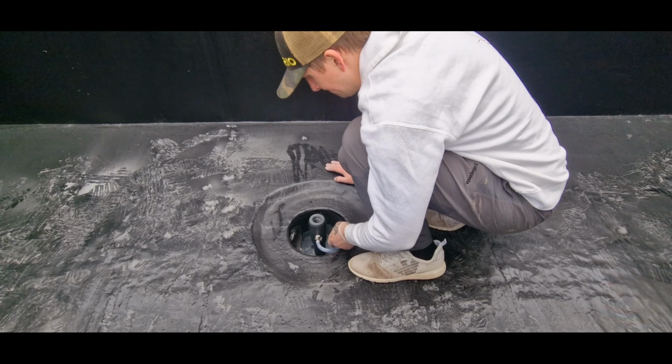So there we go. Got the 4-inch drain coming in and 4-inch skimmer. Just need to drill a hole through there with a 4-inch hole saw. And that'll go to the skimmer out there. And I've just got that set up underneath there. And I've got one of the returns just propped up under there. That's the nearest return outside there. So that's going to go on to the middle one there. And then the furthest away one's going to be the shower, because that goes straight onto the pump.